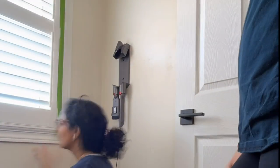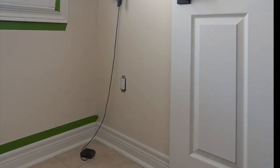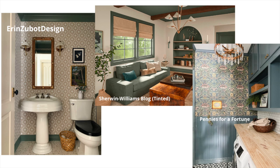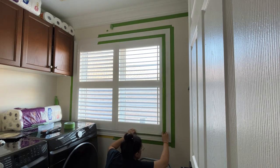One of the most controversial things I'm going to do in this space is actually paint the trim, the trim around the window, and the crown molding a really rich blue color. This is a small space and I love doing something fun in a small space. The paint-to-trim trend is really in right now, so that's the jumping point for this room. We're taking a risk by painting the crown molding but it should help draw the eye upwards because these are eight-foot ceilings — anytime you have a shorter ceiling you want to make the room look taller.